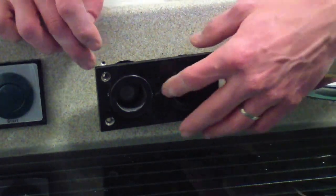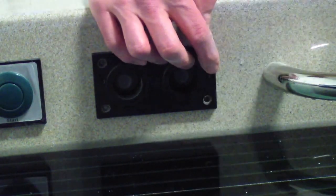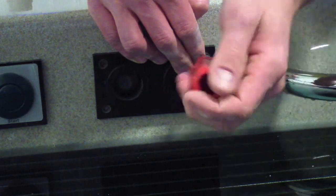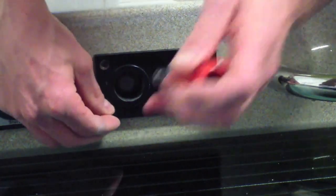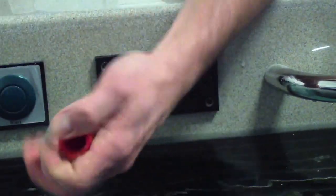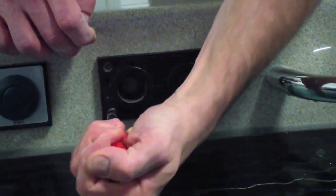Okay, now that you've got both your air tubes connected, go ahead and reset the panel with the 2 button cylinders and those air tubes attached on the back side back in. And you're going to go ahead and install your 4 number 3 Phillips screws. Be sure to tighten them down all the way so the sticker doesn't stick up when we put that on next.